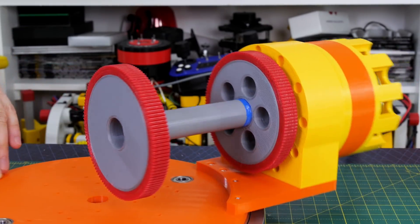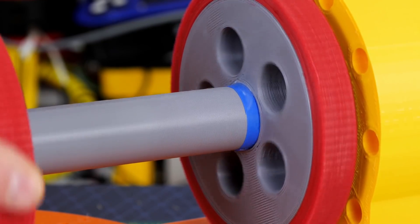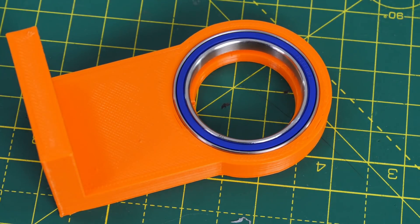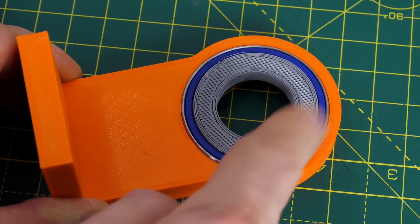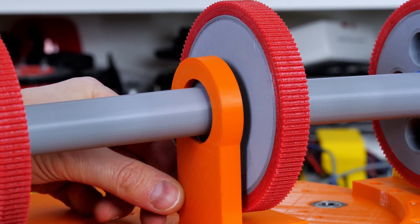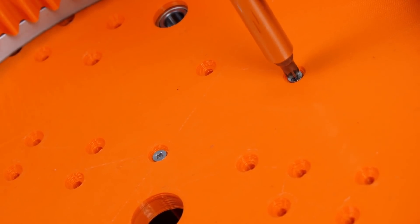That main drive shaft is going to continue throughout the whole mechanism so I've put an extension on there with another output wheel. I've used blue tape so that I can glue this on and that means I can probably break it out later and reposition it if I need to re-center it or adjust the length. I've got a bearing mounted on a bracket to support that drive shaft, and I've also 3D printed a toleranced hub that goes in the middle so it fits the bearing tight and also fits the drive shaft nice and tight. There's one more extension to the main drive shaft with another output wheel on it, all mounted on bearings on brackets - one in the middle to hold everything on center, with components mounted from the bottom with screws in countersunk holes.